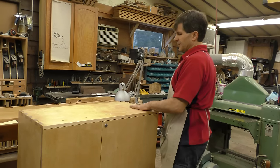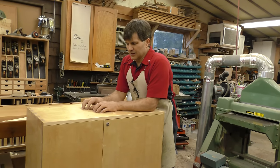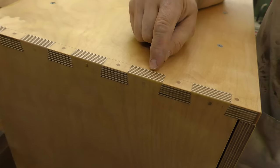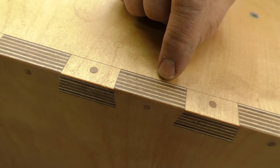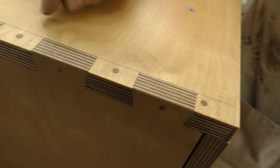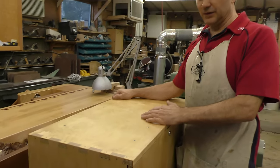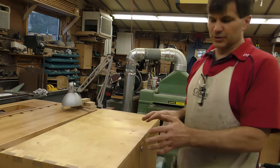So here it is. I'll start with the outside and work my way through. The outside case is made out of three-quarter Baltic birch. All of the plies are the same size, made out of birch with no voids — it's probably the best plywood to deal with. This is the first time I ever hand-cut dovetails in plywood, but it actually turned out remarkably well. My line of thinking was that with me traveling and this being shipped around, the outside case was going to get destroyed, so the good stuff is stored and protected inside.